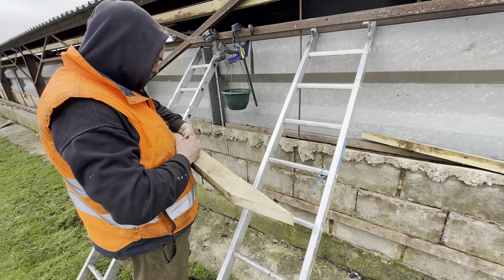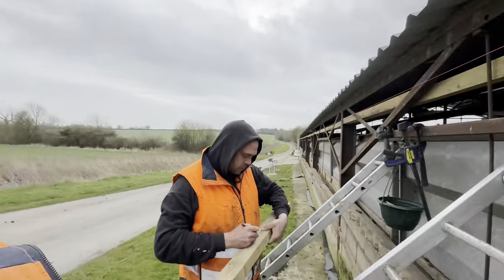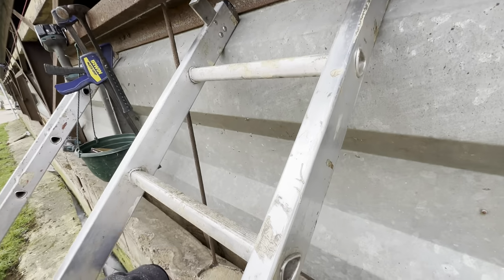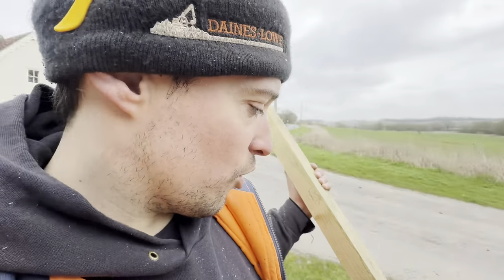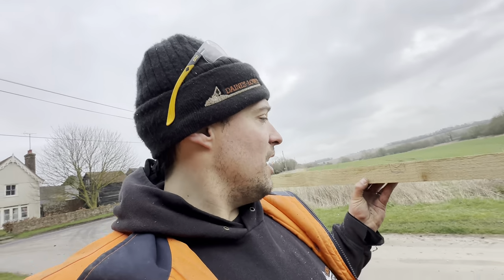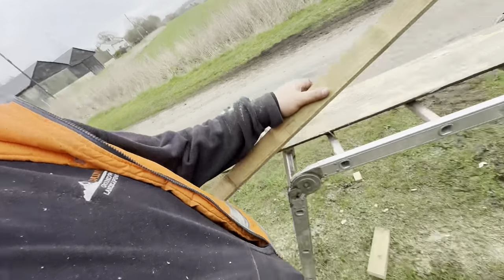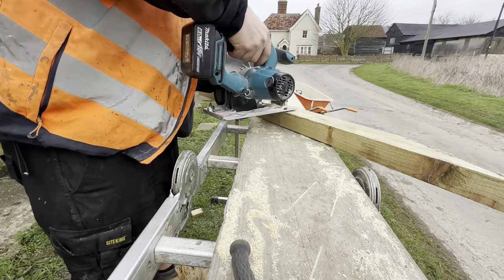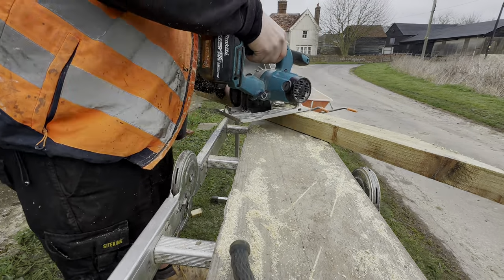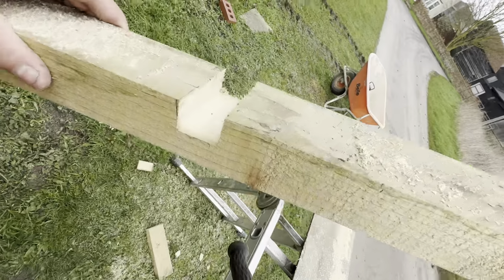Yeah. No, it's better than a sledge. Oh, and one thing I hadn't said, guys, is that on this side there are these support steel bars for the wall. So we're having to notch round them, you see. A bit of notching. I'm going to notch through that. Notch one out, Jack. The good thing is that with the rip saw, I can set it at a lower level and simply chisel that away with the rip saw rather than using a chisel. Lovely bit of notching, you see.